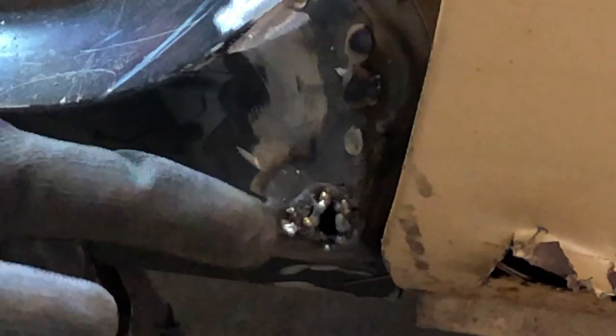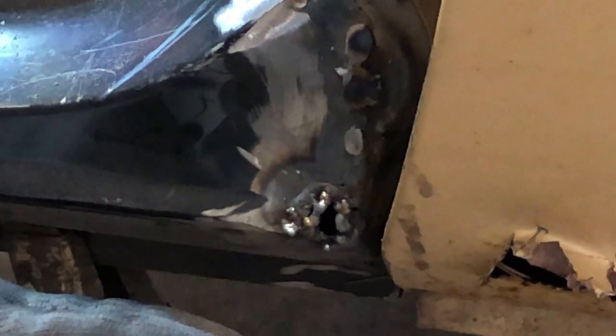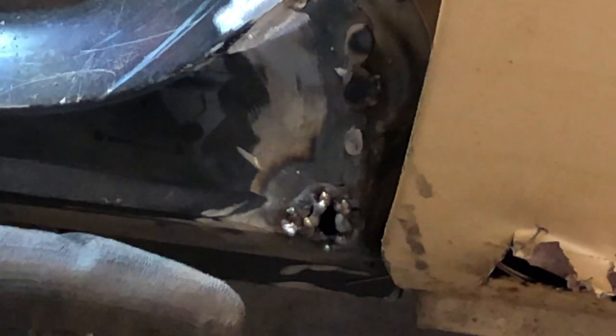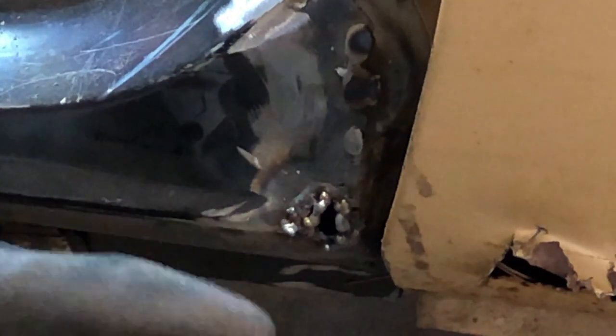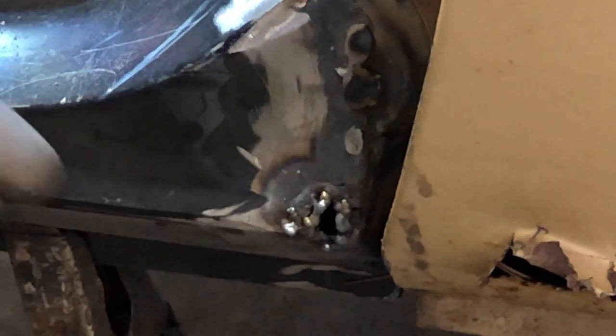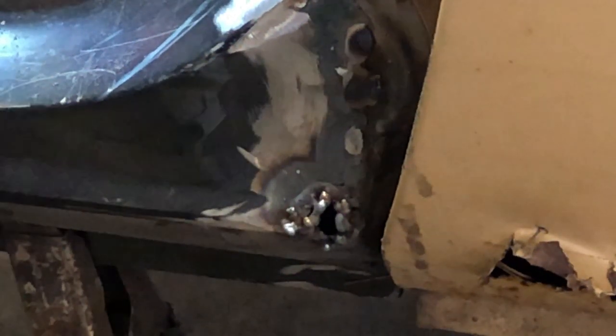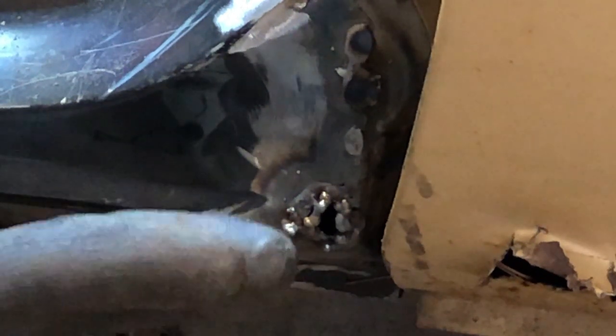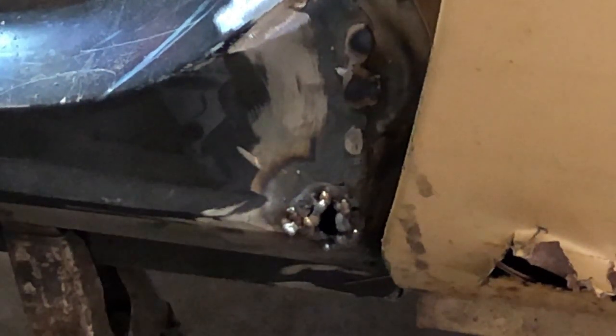It is building up and it's starting to cover the gap. I like this process and I'm going to have to use it more often — not just with filling in gaps but when it comes to putting two pieces of metal together. Quick little bursts. I know some of you guys have been saying that in the comments, but it's so tempting once you get a good weld going to keep it going. Anyway, let's carry on and see how we can fill this hole in.